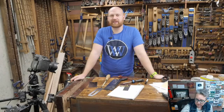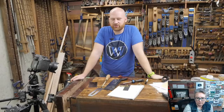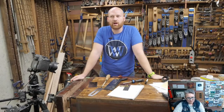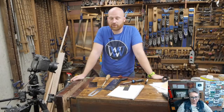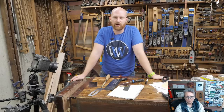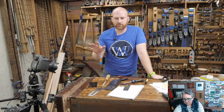Well, that is really dependent on you. It really depends on you and how you learn. If you are the type of person where you want to learn step by step and really grasp each step individually, I would start with something easy. Traditionally, the easiest and simplest wood to carve with is basswood. There's almost no grain structure to it. It carves beautifully. It's really easy. You can push into it. It doesn't splinter off. It's creamy. You do have to learn grain structure still, but it's not as much. And that way you can learn sharpening. You can learn on the easiest wood.